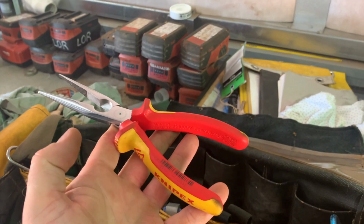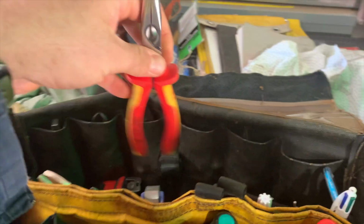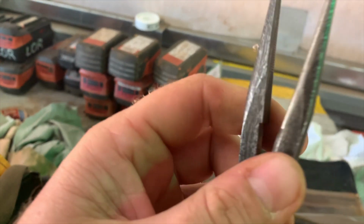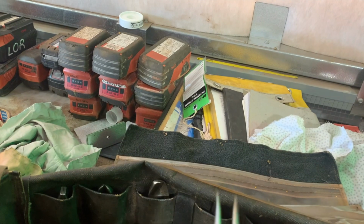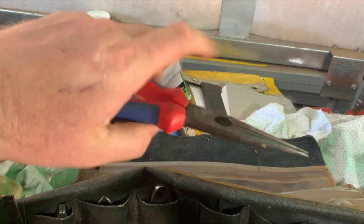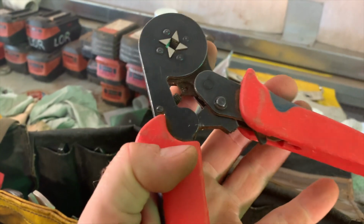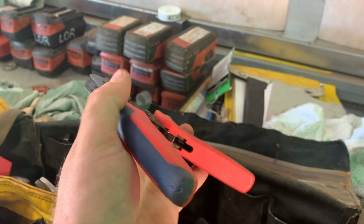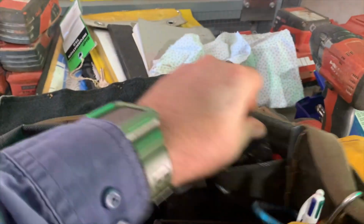My needle nose pliers, I've got 2 pairs of these, my original pair that went soft after being heated up too many times, and my new set. I've ground down the old set so it's smooth and I can bend and form cables and whatnot over these without damaging them, no sharp edges. My automatic size adjusting pin crimpers, these are awesome and it makes putting hundreds and hundreds of pins on all day easier to swallow. Never looked back since getting these.